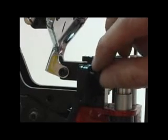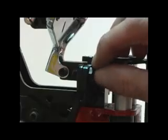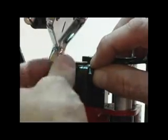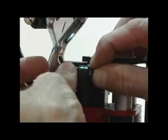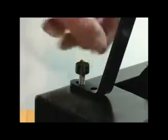First, insert the bolt through the hole in the mounting bracket and then through the top hole in the truss rod on the left-hand side of the reloader. Finger tighten the nut. You may find it easier to insert the bolt by tipping the measure assembly back. Using the provided T-bolt, install the lower truss rod to the provided mounting hole at the left rear of the Mec Automate and securely tighten.